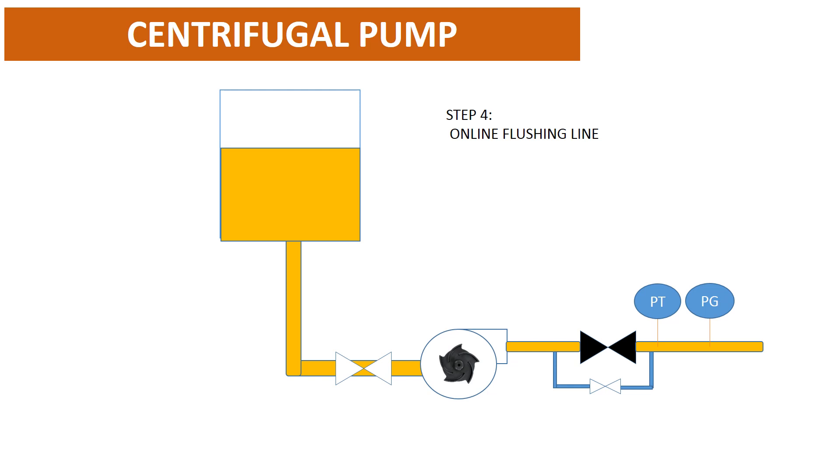The proper value of external flushing flow rate is dependent on the manufacturer. Step 5: fully close the discharge valve and warming up valve. The warming up valve, or heating up valve, is designed for heating up the pump during pump stop to avoid liquid accumulation and gas inside. In normal cases, the warming up valve is kept open to warm up the pump continuously. Regarding pumps equipped with an overheating prevention valve or minimum flow valve, open that valve before starting the pump.